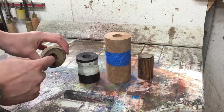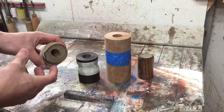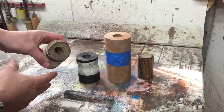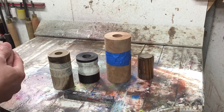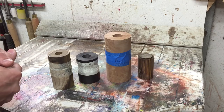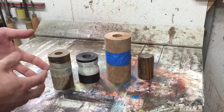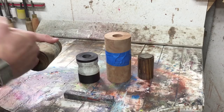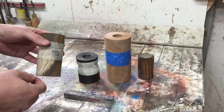This shows the amount of material I take out in the middle. When I first started roughing out I would take a lot more material out — that quickens the process because there's less wood to dry. But it restricts what type of box design you can make, because you've got a smaller wall thickness. You might have a favourite shape now and rough out dozens of boxes to those proportions, but in three or four years that shape might not be your favourite. Nowadays I just take a small amount — just about enough to get my little finger in — which is enough to relieve some tension from the middle and allow air to get in.